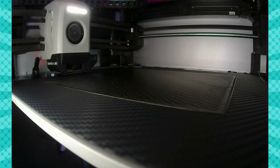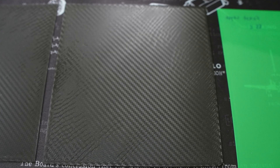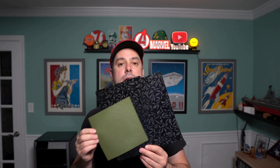Here's a quick time lapse of that carbon fiber plate print. Here's one that actually messed up due to adhesion issues — you can see those in both the green and black on the surface. The diamond pattern turned out really well, but it took a little bit to figure out the adhesion. Ultimately it came down to just really cleaning the plate well, and I found I've had to clean it after every single print. I'm not sure if it's just this particular brand — the link will be in the description if you want to check out the exact ones I used.